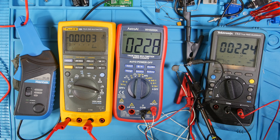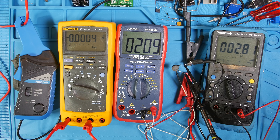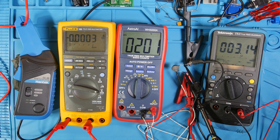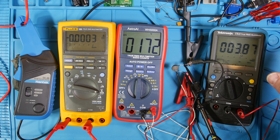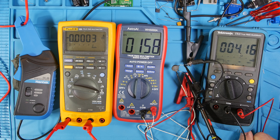It'll limit the current, and eventually it'll allow the current to flow with only 0.34 ohms drop. Now, if we're not pulling 2 amps, this guy won't heat up quite as much and it'll have a little bit more ohms drop. We're going to drop about a volt from our 120 volts — so that's not a problem, it's a 1-volt drop. And if the current's less — say it's linear and we're only drawing half that current, around 1 amp or 1.25 amps — then maybe this goes up to a 2-volt drop. If we draw less power, that's not going to be a problem on 120 volts either.